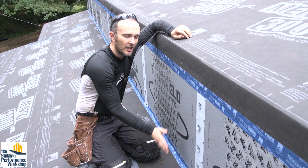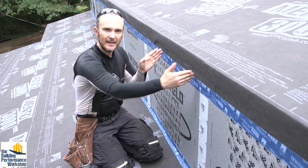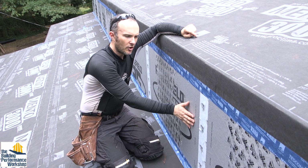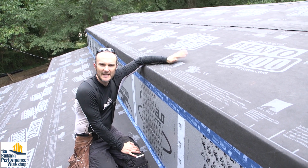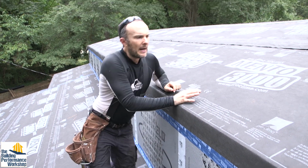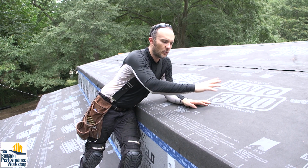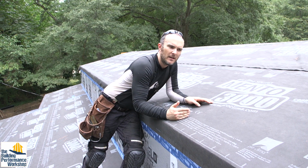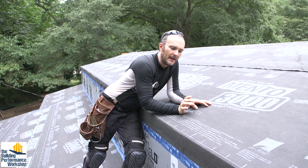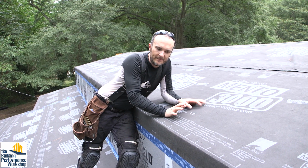And then over this is going to go exterior insulation, even up over the ledger between where we've got the eave members coming out. So exterior insulation on all the walls, no exterior insulation on the roof. That's because the energy model told us that that's not necessary. We have R38 in our roof. And then we're going to do the butyl back tape here so that we can make sure that when our battens go down, and the battens are going to go this way, it's going to be CoreVent, those are not going to be penetrating this airtight, watertight, vapor open underlayment.